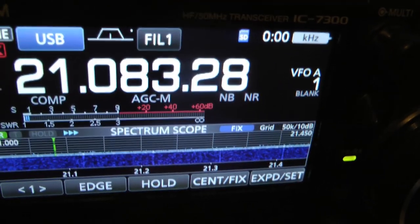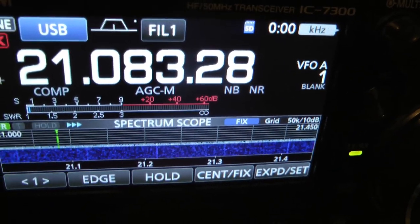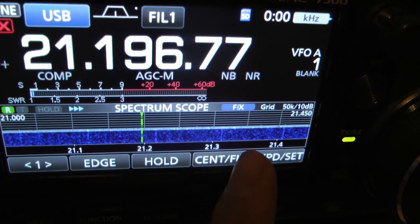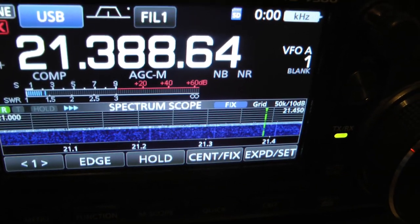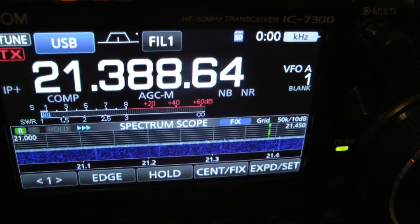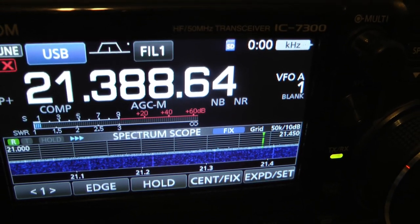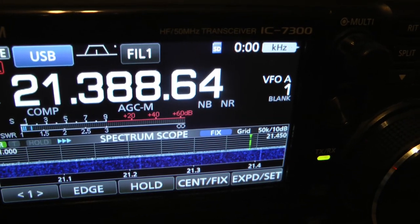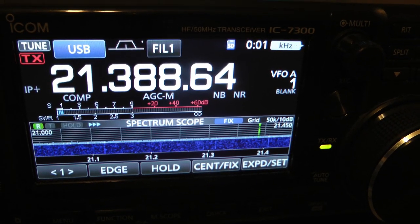And here's the results. As you can see, you can barely see a little line — trying to get my finger up here — the line here, or here, or there. But that's it. So it's so much better. I think the toroid coil, and maybe the ground wire to the silver screw on the power supply, probably helped a little bit as well. But I'm not getting any noise on any of the bands now, and it's very, very quiet.